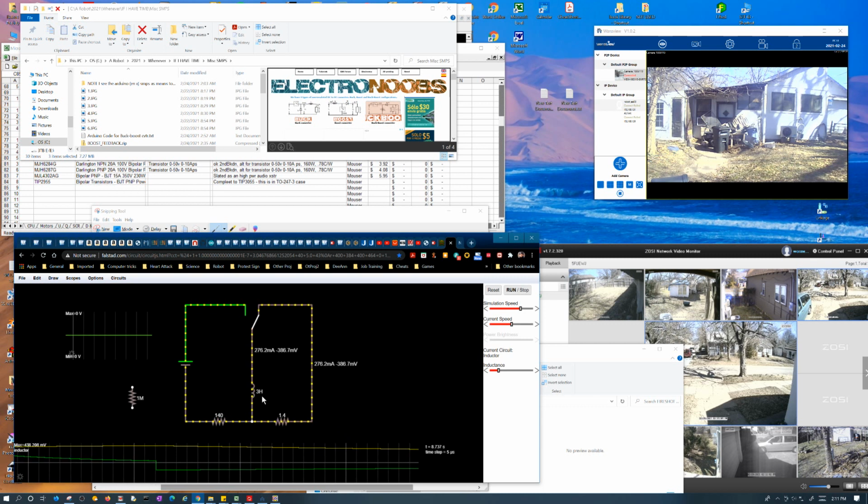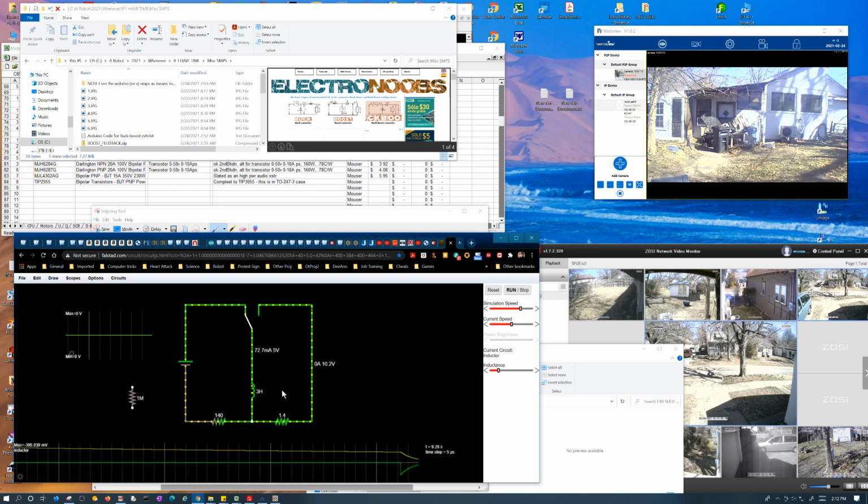But of course, inductors have a caveat. They have a maximum amount of energy they can technically store before their core saturates. Like a capacitor has a maximum amount of energy it can store before it just runs out of capacitance, inductors are the same way. The bigger the inductor, the more energy it can store, I think. I'll have to look into that, though, because I think inductance and saturation are really different properties. I think you can have really high inductance but an easily saturated core, I'm not sure. But anyway, I've got to look into the whole inductance thing.